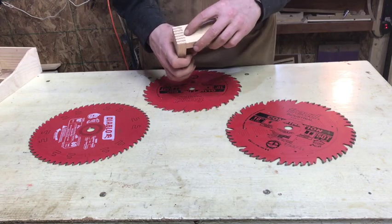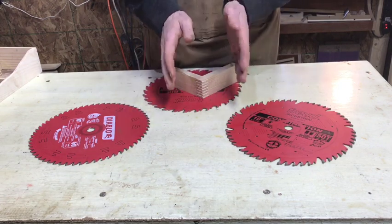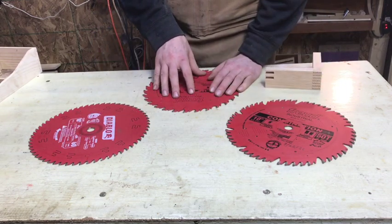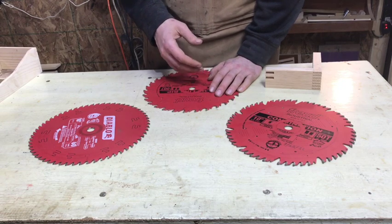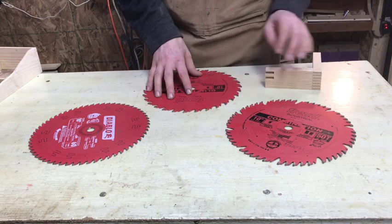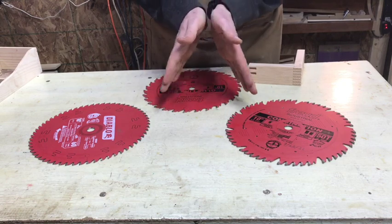You'll have to look for a rip blade if you want a perfect seam on the end. If you use anything other than a flat top grind you will get a noticeable gap from where the ATB teeth go out to the side. Most combination blades will not leave a perfectly flat bottom, however they're going to be closer than purely alternating tooth bevel and closer than a triple chip grind. So if you're using this for something with visible aesthetics, I highly suggest getting a flat top grind blade, which is usually a rip blade.